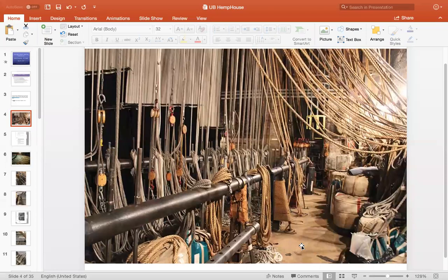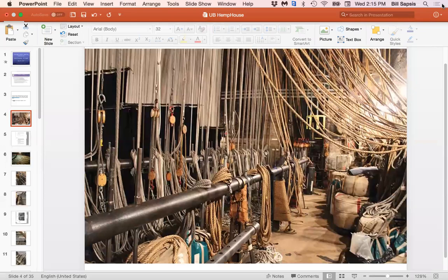Someone's asking if we use capstans to rig heavy units. We didn't have a mechanical capstan. We had a hand-cranked capstan that's actually adapted from sailing, but it was a 6-inch diameter capstan. If it was a really heavy piece, sometimes we'd use the working line from the block and fall. Sometimes we just used a piece of braided Dacron that was attached to the Sunday and wrapped the braided Dacron around the capstan winch and then tailed it off around a couple of pins so that we could control it. With somebody cranking the winch, somebody tailing the winch, and somebody manning the wraps for safety, you could get a 1-1 lift on it that way, which made it a lot faster. So you didn't have to reset a block and fall to get to trim. So yeah, we did use a hand crank capstan winch.